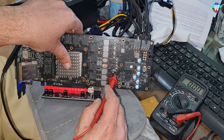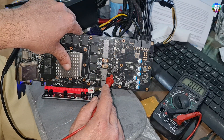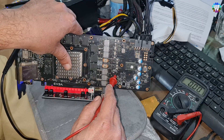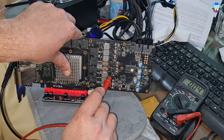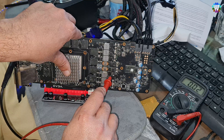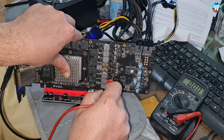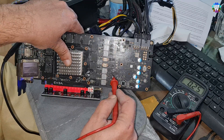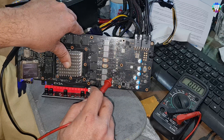This could be the fault, because on the working card this part shows 12 volts on that side and zero volt on that side. But this one is showing zero volt here and 0.06 volt — it's reducing now, down to 0.03, 0.02 on this side and zero on that side. The bottom side is showing 12 volts, so basically that part is fine and doing the right thing.